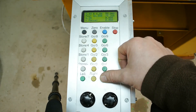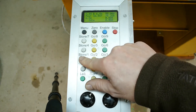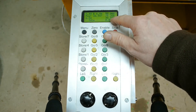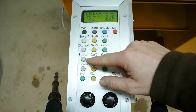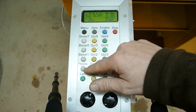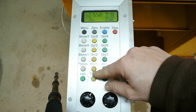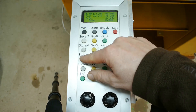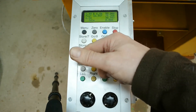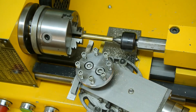One last feature is that when we are in a good position reached during work, we can do a long press on the store button and the current position is taken over into memory. By this we can change between different positions, which is actually the most-used functionality — you cut to some position using the normal controls, store the position, go back, and continue cutting while controlling the y-axis manually.